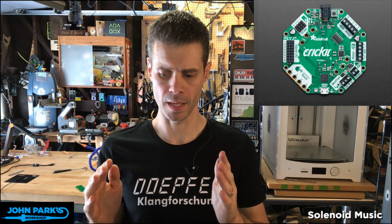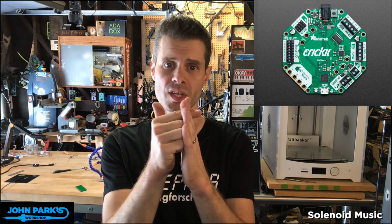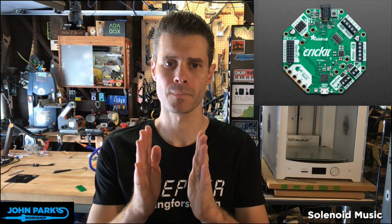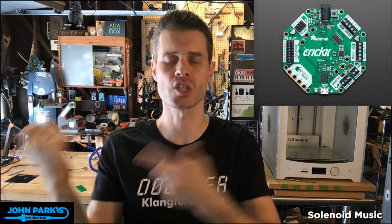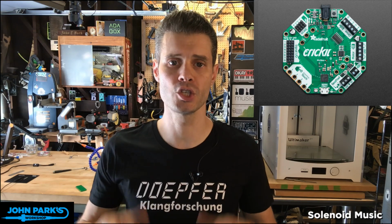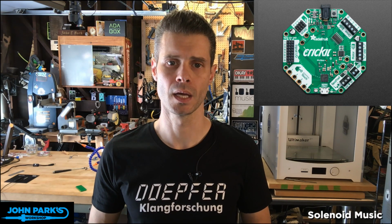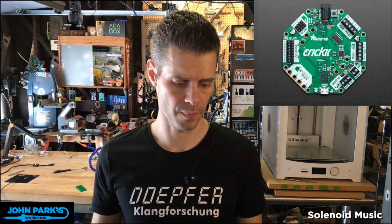So it's an easy mistake to make, thinking, oh, I'm going to have this thing pushed out for a half hour, and then when someone presses a button, we can open it. You want to have it so that they are not energized most of the time, and then for a short period, you'll energize them, usually to flip a little latch so that you can open something. And we'll be talking about that as we get into this project. The rule of thumb I use for the duty cycle of a solenoid is about 25% of the time on, 75% of the time off, so that you don't burn it out. They can get hot and they can get angry.